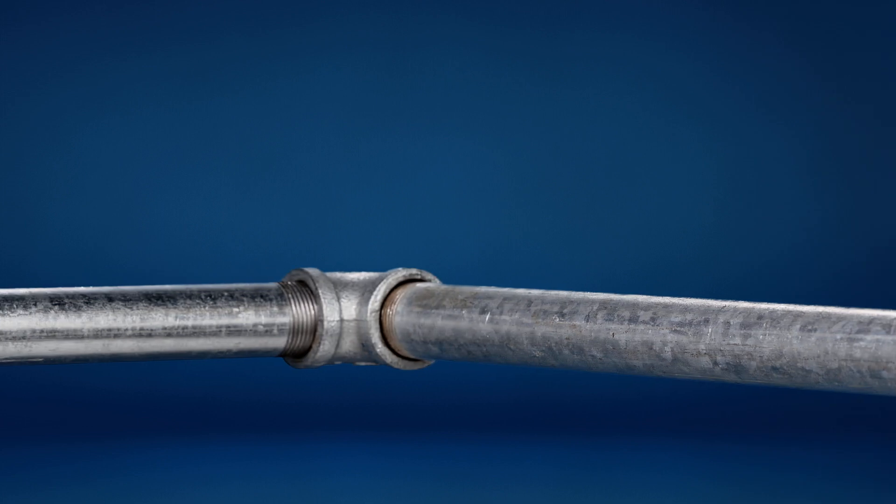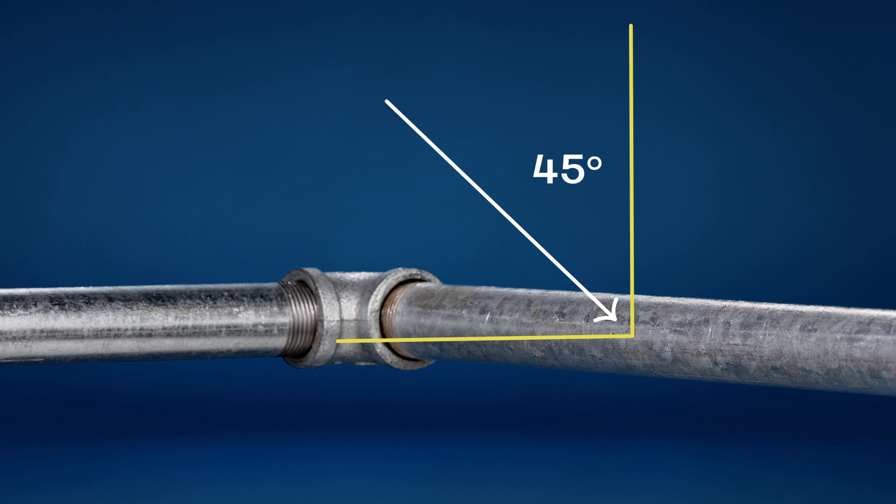For horizontal installations, sometimes there can be hard water buildup on pipes that may impact ultrasonic signal quality. To avoid this, install the BlueBot at a 45 degree angle, if possible.